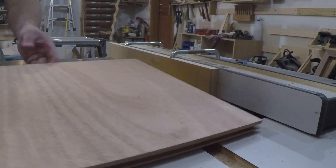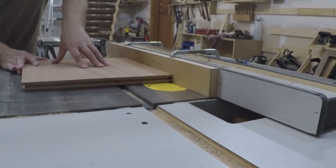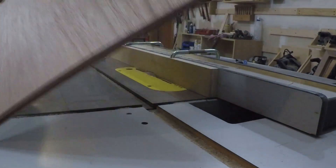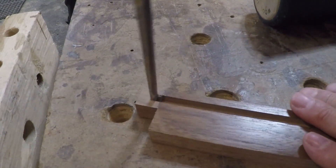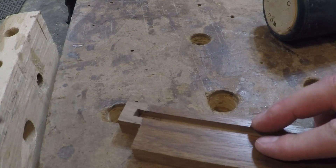The final step for the lid was to cut a decorative chamfer on the top. I set up a sacrificial fence, tipped my blade to 45 degrees, and raised it up into the fence — just a real nice way to cut a quick chamfer on the edges. One final thing before gluing up the case is I need to square up the rounded ends left over by the router bit so the bottom and top will just drop right in.